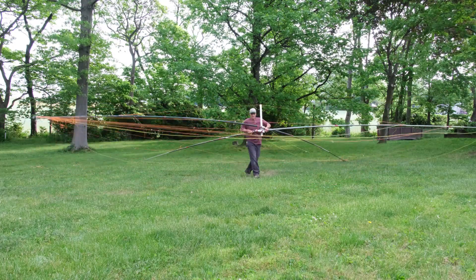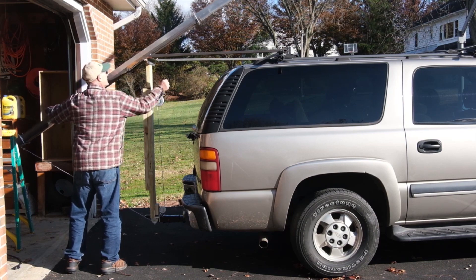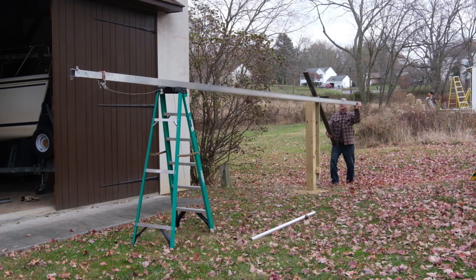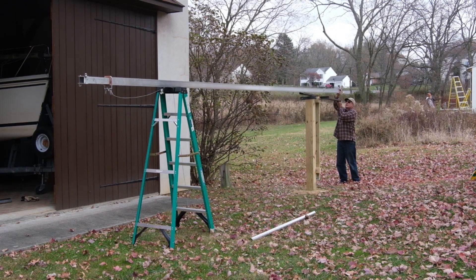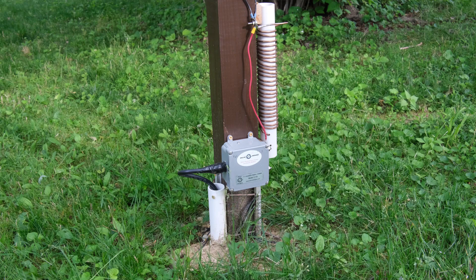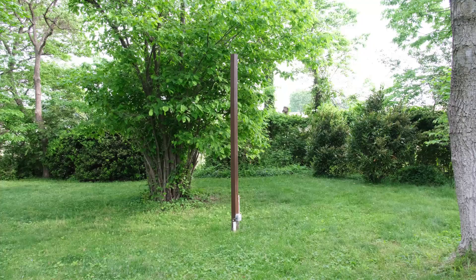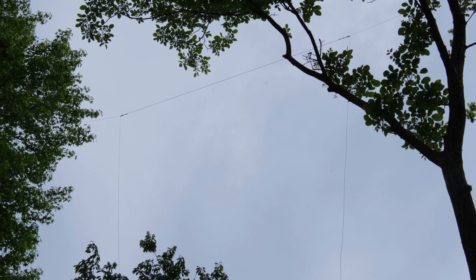I think it weighs about 26 to 30 pounds, I'm not quite sure. Now over to this mast — you'll remember last year I made the video on this mast that I tied on the back of the car. It was a good idea for a vertical but it really wasn't braced well enough to support a beam, though it worked really well as a vertical in the backyard off of this post. So I made it out of wire. This is the feed point — it feeds one wire for 160 and the other wire for 80. The coil matches the impedance for the antennas to 50 ohms, with ground buses for the radials. The post wires separate at the top, going up about 60 feet — the 160 goes to the left and the 80 goes to the right.